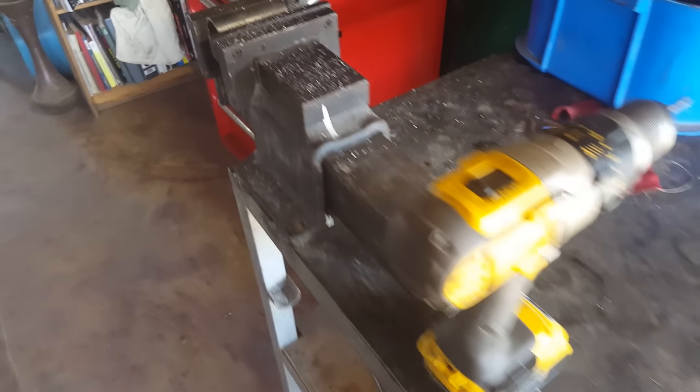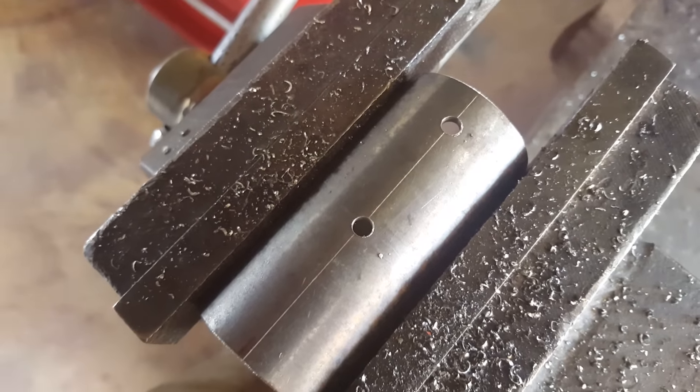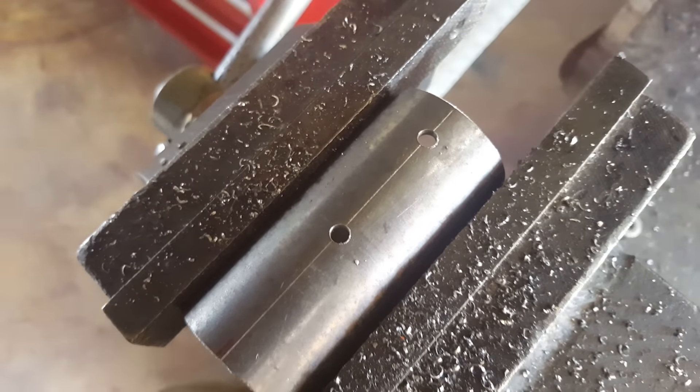Anything else on the back of Black Dragon Forge — tapping. This one here is drilled 4.8 millimeters and I'm going to tap it M6. Traditionally you use a tap handle like Tulu is doing here.